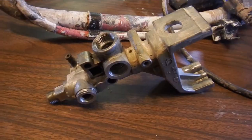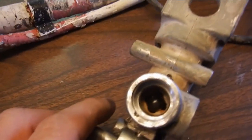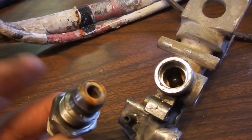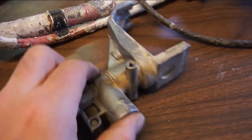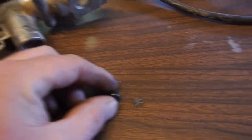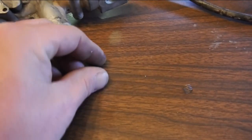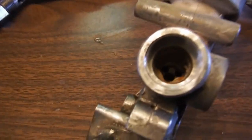I'll pop them out and show you what they are. I've turned this pump upside down — this is the intake valve and it sits in here like this. Inside of here there's a ball bearing, and that rests perfectly up against this hole. After it pulls the paint in, this ball comes down and seals the hole from paint going back outside. Inside here you have your ball and a tiny spring. If you're having problems with priming out on a work site, you can take this valve off — but make sure you don't lose that tiny spring, and of course it'll be full of paint too. That's what's inside the intake valve.